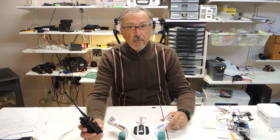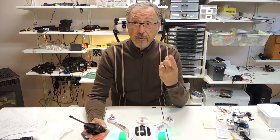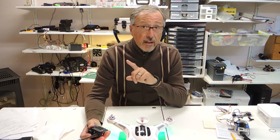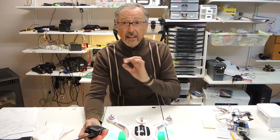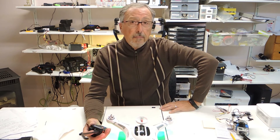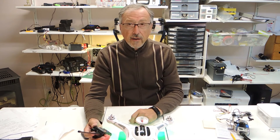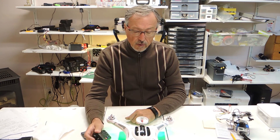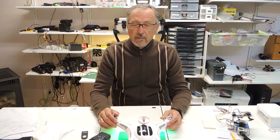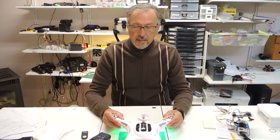I got a 4.1 reading — that's the voltage on the T Beacon's battery, which confirms two things: the T Beacon is functioning because it's plugged in, and I have voltage for the flight. When you're done flying and remove the T Beacon, you'll need to turn it off manually. That's actually a good thing because during a crash your battery may fly away, and you don't want the T Beacon turning off just because there's no main battery connection. So you have to turn the T Beacon off every time you remove it from the craft.